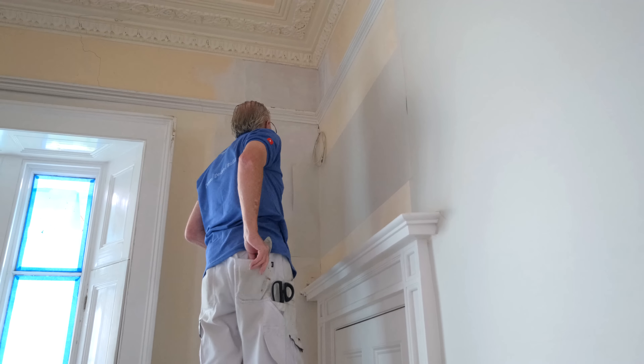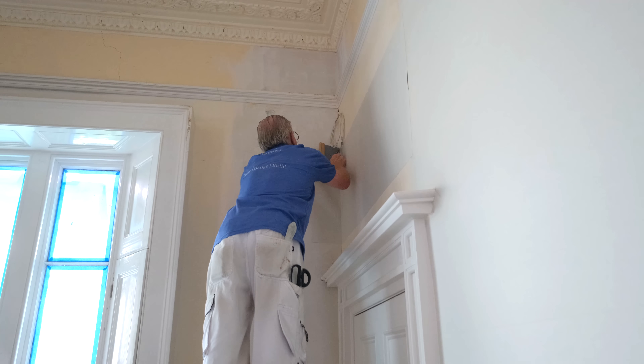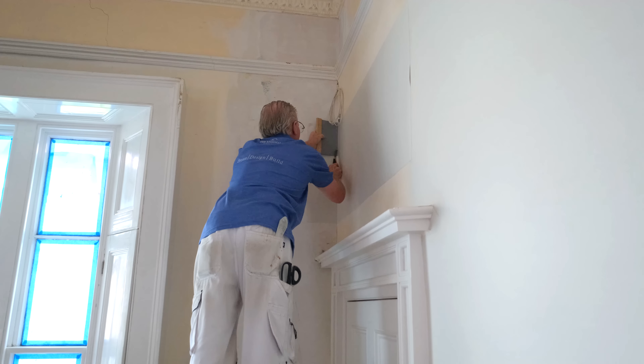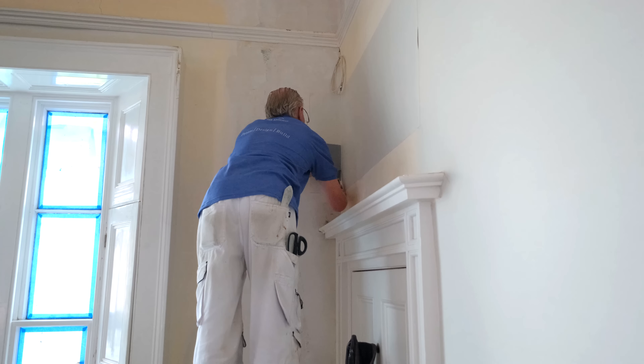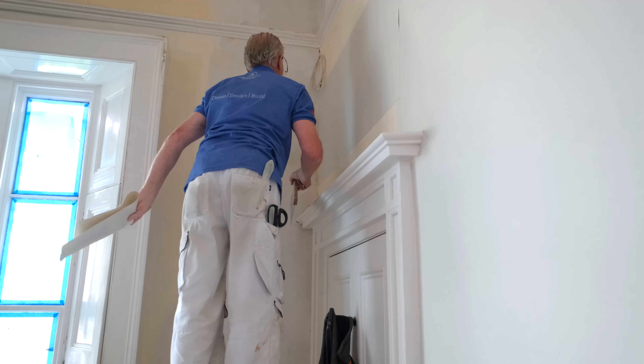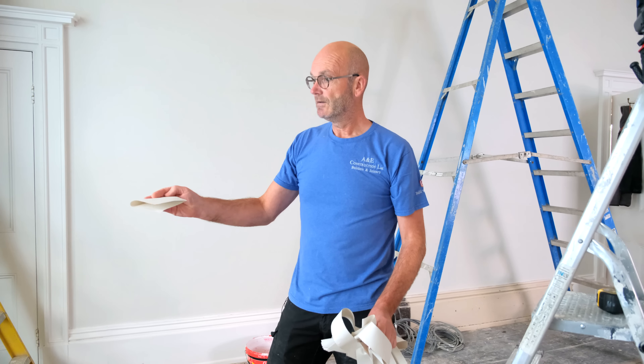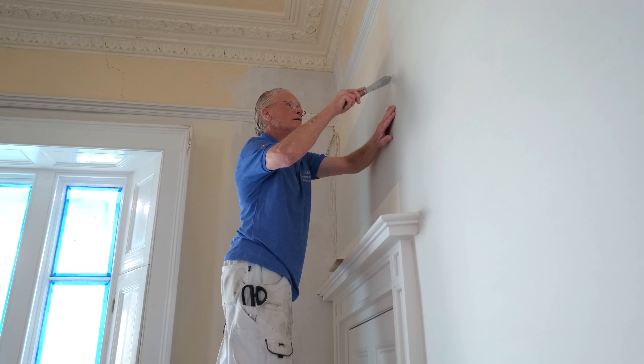Watch this — a little trick. With a nice sharp blade, put it in the corner, one, two, three, four nice little cuts, rip that off, and drop the waste on the floor. Good tip for the offcuts when you cut them off: the paste is on that side, so just fold them in half before you put them on the floor so you don't get paste dropping onto the floor.